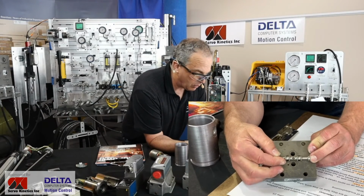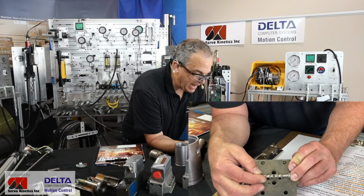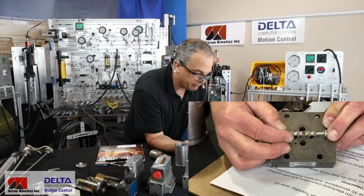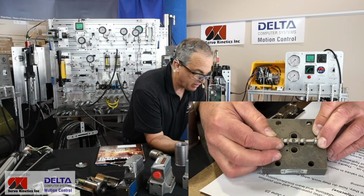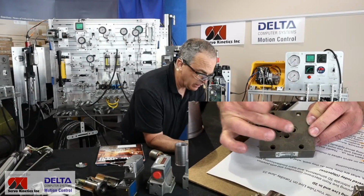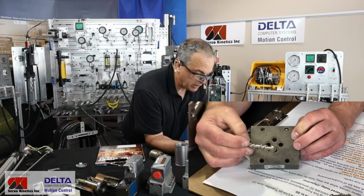But the control that the rotary torque motor, or the rotary motor, has over the movement of the spool is very precise. Insanely strong magnetism in the middle of the drive works on the motor part of this valve, so this is a valve spool that can be moved back and forth very precise amounts to let flow out of either your A or B work port and drive your hydraulic cylinder.